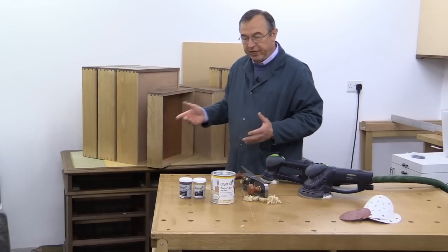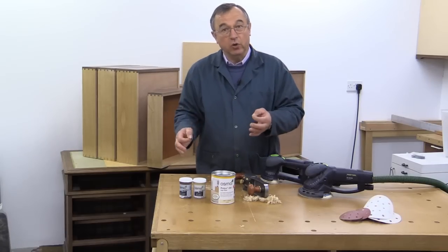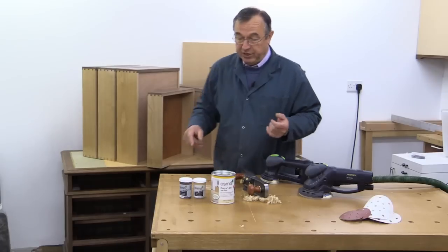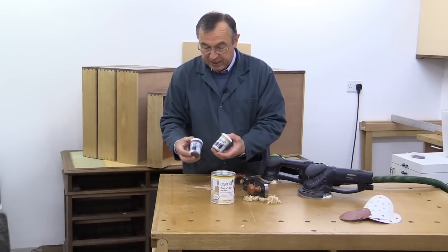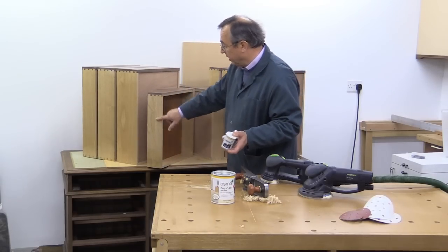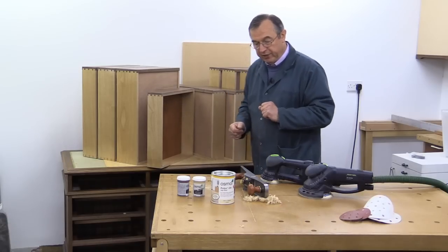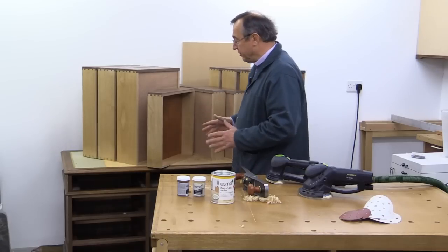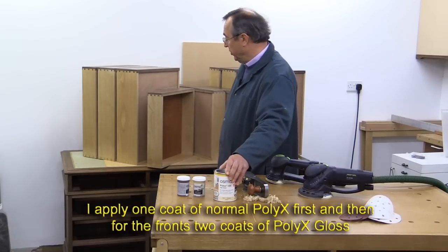I also need to check for serious defects — a knot hole that needs filler, or even a little chip-out from one of the dovetails, which does happen. I've got two flavors of Osmo ready mix filler: one in walnut, and one that calls itself maple birch, which is close enough to this chestnut. After that dries I'll go through several stages of sanding, and once I'm happy with the fit I'll apply the Osmo Poly X to the drawers.